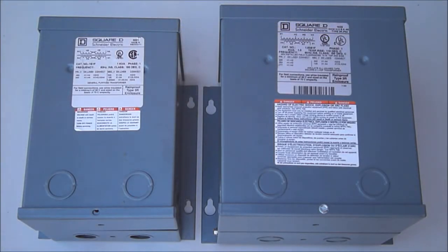Ventilated transformers by Square D Schneider Electric, which are 15 kVA and over, require weather shields to make their enclosures outdoor-rated or NEMA 3R. This is because their enclosures have vent openings which can let in rain, snow, sleet, ice, etc. The weather shield is a metal awning that prevents wet weather from coming in the vents.